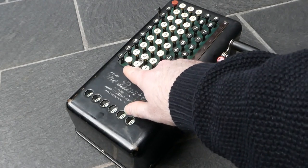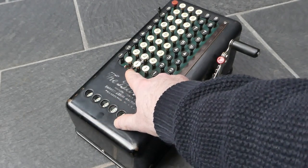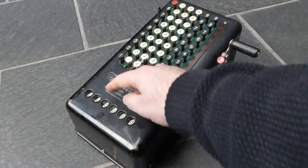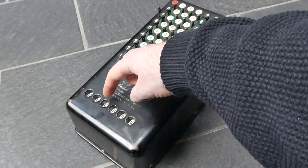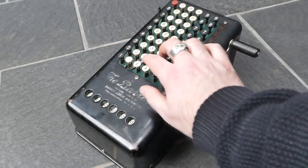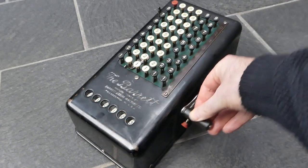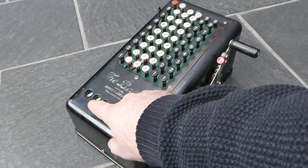There's one more thing: a small switch. If you move it to the left it activates the item counter, meaning the leftmost two digits of the register are used to count the number of additions. Those are separate from the other four digits which form the total — there are no carries from the fourth to the fifth column. So if you add a number it adds it to the total and increments the item counter, even if you add something really large.